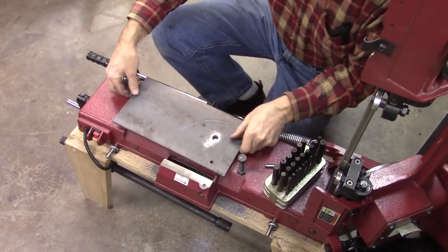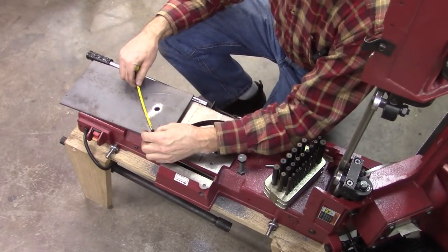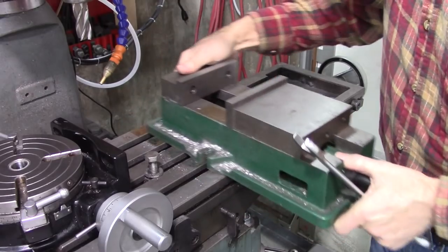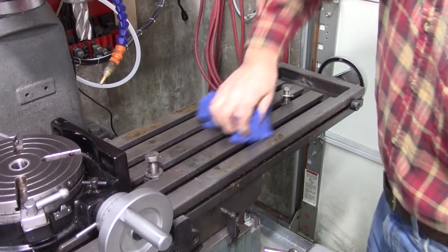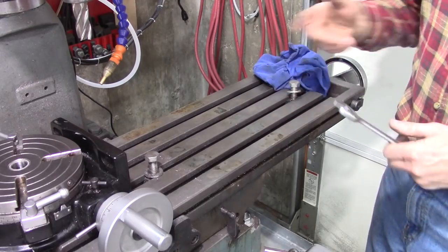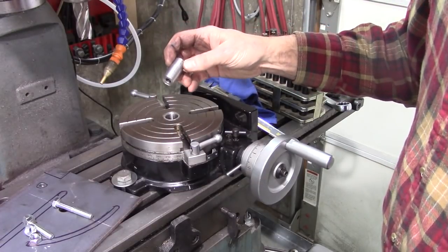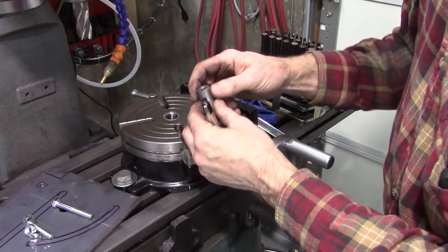Right there I just described the exact arc of that — that's a rough casting, it's unfinished. So when I set this up on the mill I'll be able to dial this in. Looks like four and three-eighths. I was kind of curious how much corrosion was under that vise using the water-based coolant — looks pretty good. I cut a really crude taper there on a plug; I'm going to cut that off right there. That'll serve as a center for my radius.